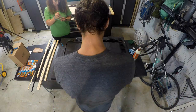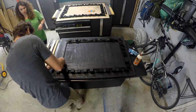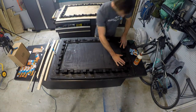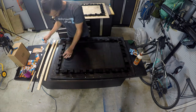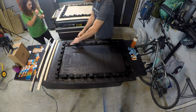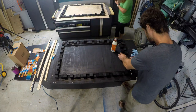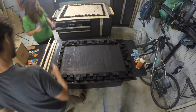The gluing process was actually pretty simple, but we have a few key learnings to share. We ran a long strip of wood glue along the length of each row, since it takes longer to get tacky and cures overnight. For the superglue, we applied it around the entire bottom of each block immediately before placing it on the board, then held the block down for a good 10 seconds to really allow the superglue to grab.